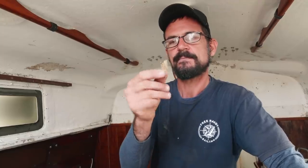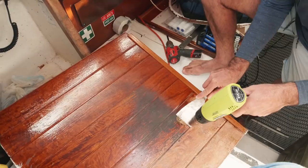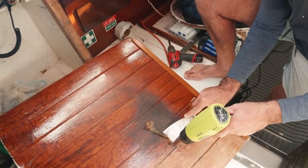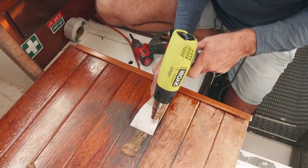So that varnish was in pretty poor condition — lots of gaps had worn away and things like that — so it's coming off in small sections. But it was still pretty quick. Oftentimes when you've got a nice thick varnish coat but you just want to remove it, when you hit it with the heat gun it'll often come off in one big ribbon.